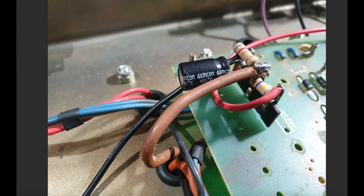It's a 470K resistor. This is a screen supply, which is going back to the board, and you'll see where it connects to when I show you a zoomed out picture. 82K resistor here to ground, that's been grounded. That black wire there is going across the ground. And here's our 10 microfarad cap as a smoothing cap. And this brown wire here, which is soldered to the midpoint, is our 65 volt DC reference. So this is the center tap for the heater supply.